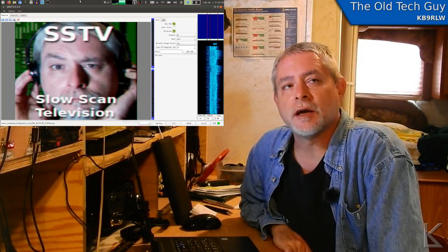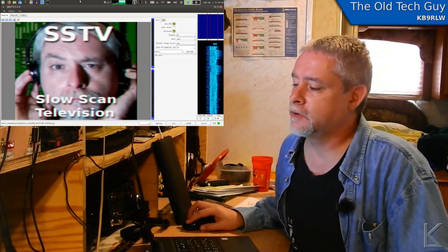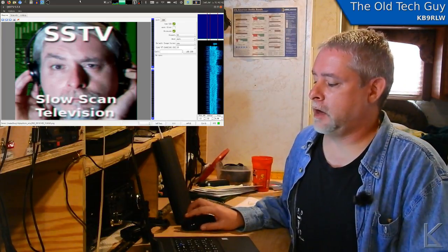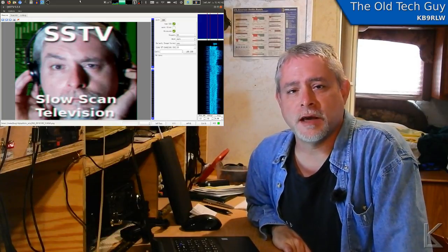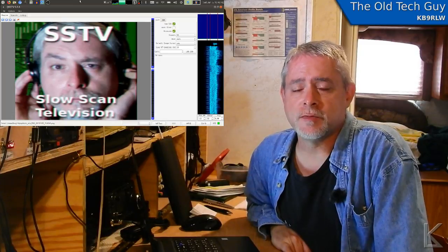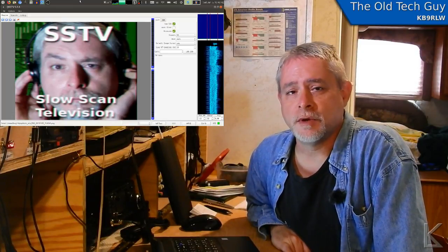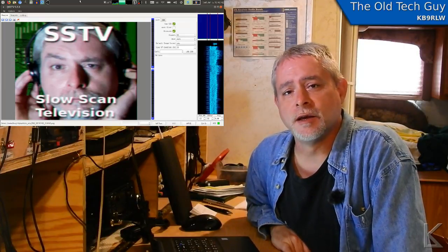40 meters, sometimes you'll hear slow scan TV on 7.171. Is that right? Yeah, I think that's right. Yeah, 7.171 is where you'll find slow scan TV on 40 meters, usually in the evenings. But 20 meters is by far the most busy. If you can tune to 14.230 most days and find some slow scan TV activity.